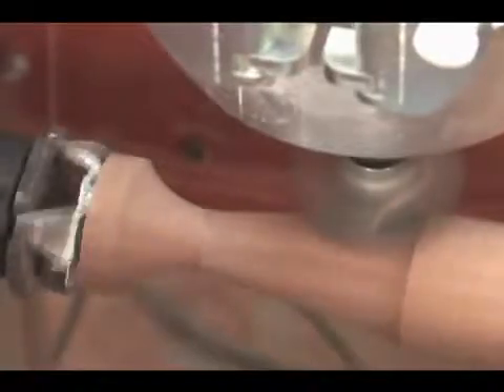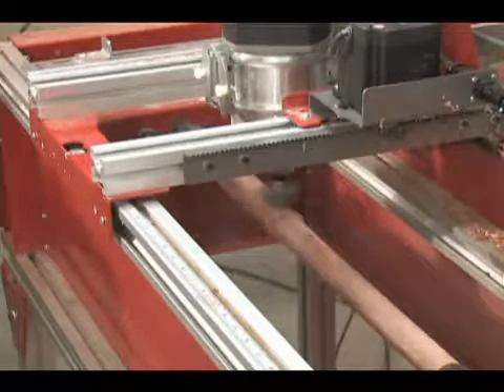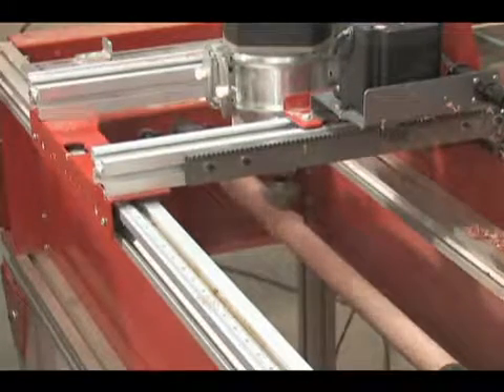By positioning the Y-axis just 50 thousandths of an inch off center we get a beautiful finish when using the mill as a CNC lathe. The contoured section will blend in with the straight section.